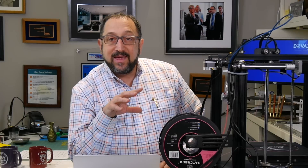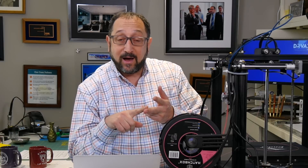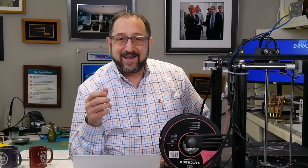The Google Slides deck I used to explain this will be attached in the notes — it has all the steps you should take. Bring your printer up to temperature, send a command to extrude 100 millimeters of filament, measure what was actually extruded, use the algebra in the slide deck to calculate the new steps value, use an M92 command to put that value back into the firmware, and use M500 to save it to EEPROM. I hope you learned something today. If this was beneficial, give me a thumbs up, subscribe, click on that bell, recommend this to your friends. Have a great day, and let's continue to learn things together.